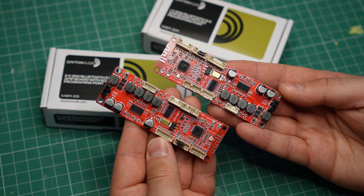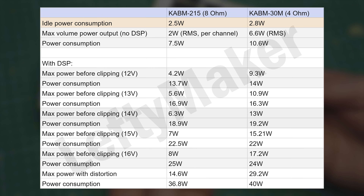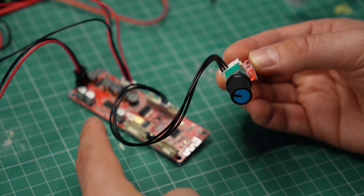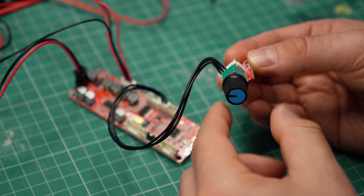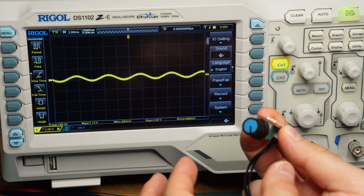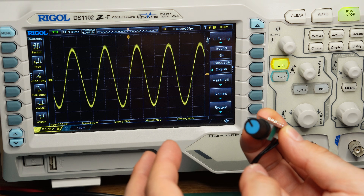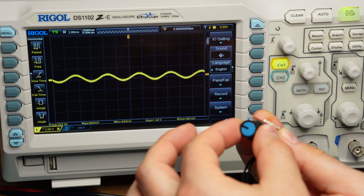So after testing both amplifier boards, here are the numbers that I got. How much clean power you get out of them depends on the power supply voltage, but in any case it is much lower than the advertised number. Another thing I want to mention is that the volume control is kind of weird. On the bright side, it is done digitally, so you don't have any analog signals running to and back from the potentiometer. On the other hand, the volume control is not immediate — there's a delay. It seems like the change in volume is done in linear steps, no matter how fast you turn the potentiometer. I wish there was a way to have normal, immediate volume control.